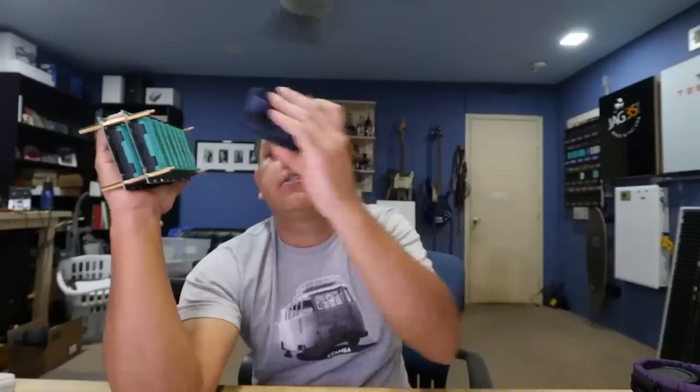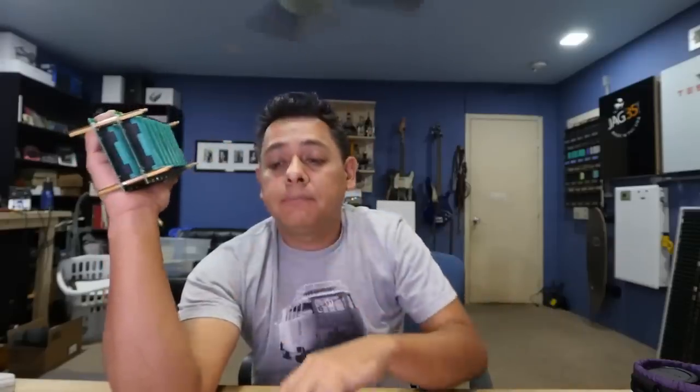The way you do that is you put these 6-7 groups of batteries, you load it up, and you use something like this where it checks each individual voltage. If you see one of the groups dips more than the other ones, that's an indication that group is weak. So you have to maybe swap some cells from other groups into that group, interchange things, so that when you load them up with a certain amount of load, they all drop the same. That's another way of telling the internal resistance, their ability to push power out. So that's what you have to do.